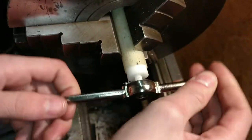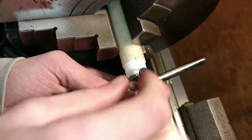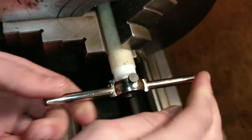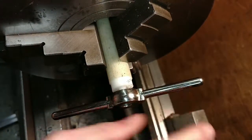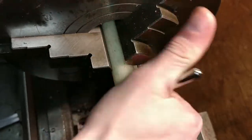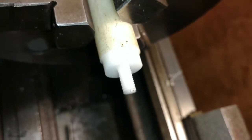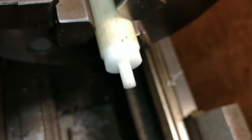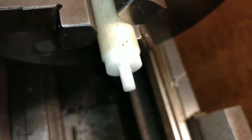Good. Just a half turn is enough. That's okay, it doesn't really matter. You're going to take it off and finish the thread by reversing that die anyway, because this die won't thread all the way to the shoulder. It looks like a pretty nice thread. That's because you got some pretty nice tools. You're going to chamfer the end of that? Yep. Actually, it's probably too long. If you make it really long, it'll probably help center the helmet on your head when it screws into your skull. No? Okay. Let's not.